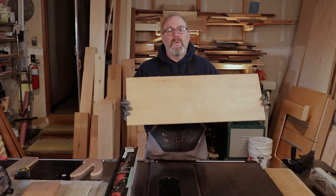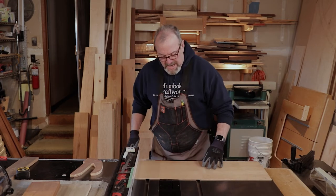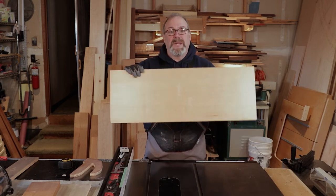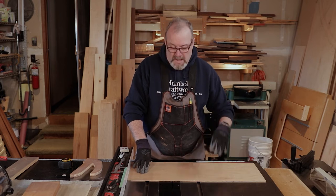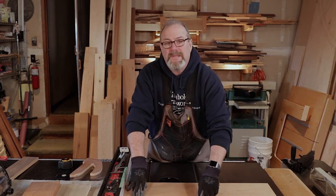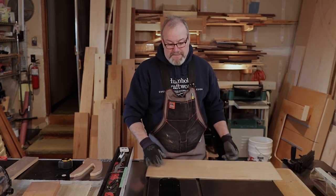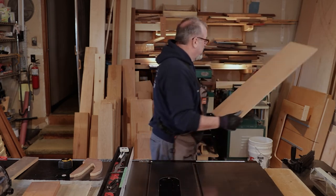This is the biggest culprit in the world right here. They've got themselves a piece of 1/4-inch plywood. I'm just going to cut this off like this, and I just need a little piece. 1/4-inch is the biggest culprit I've ever seen for something that's wider than it is long. Somebody thinks they're going to cut it, whether it's the tail off that gets hit or this piece, and it somehow twists and comes right back at you. You don't think it's going to hurt, but it hurts.